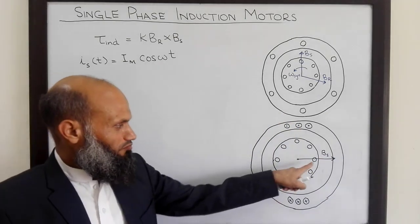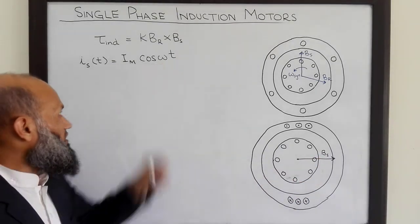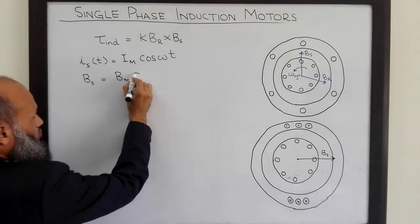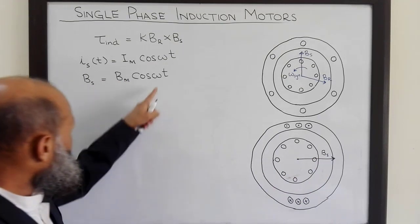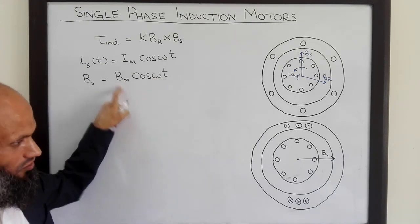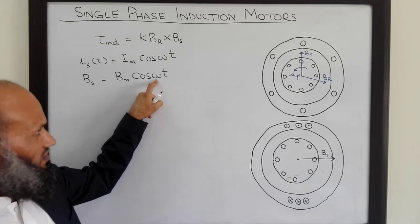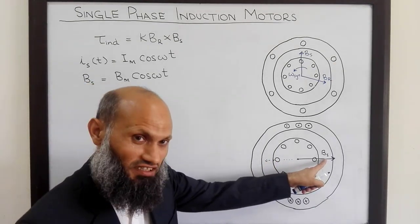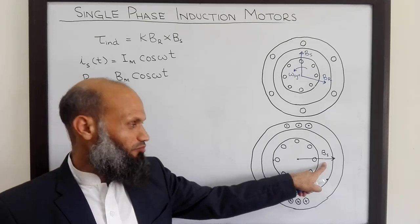The magnitude of this stator magnetic field depends on the magnitude of the current: Bs = Bm·cos(ωt). So the magnitude is changing — at ωt = 0 its magnitude is Bm, at ωt = π/2 its magnitude is 0. However, it is not rotating; it is always in the same direction. At ωt = 180°, its direction reverses, which can be taken as the same direction with a negative magnitude. So this is not a rotating magnetic field — it is only a pulsating magnetic field.